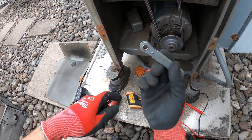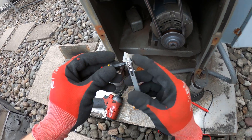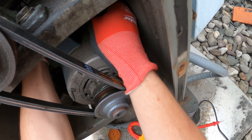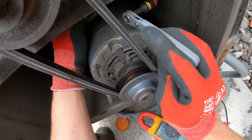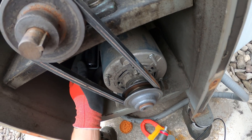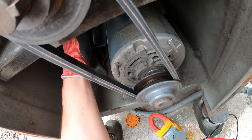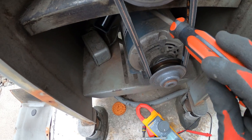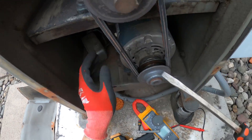This little tool is super key — put in all your little fittings, just super soft with my drill. I want to get inside this little cover up here. This should be a little capacitor, I believe. Just want to double check that. Yeah, there's a little cap in here. Let's see what that's reading. Always going to want to discharge your capacitor — just take a screwdriver and go across both spade terminals to be safe.